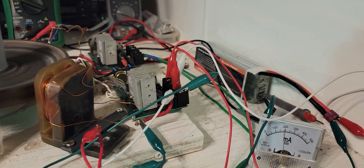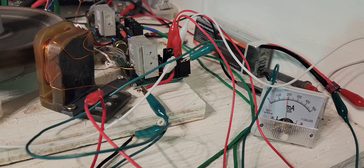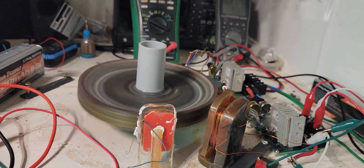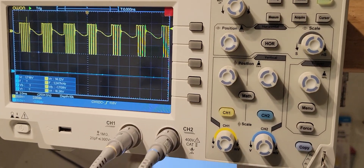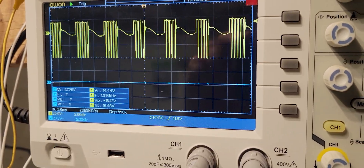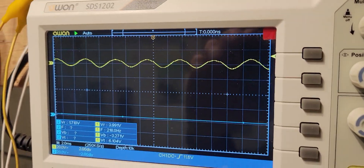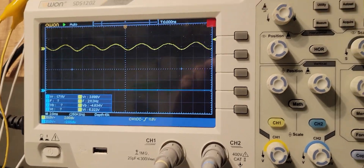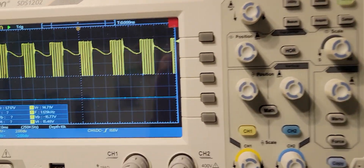I should have showed this in the first video. So that's the input right there. The motor is going pretty good, it's somewhere around 1600 RPMs. It should be somewhere around 200 Hz or so. I'll take the power off and it'll show me the frequency - it was somewhere around 220 Hz, so it's close to 1600 RPMs. It works out too.